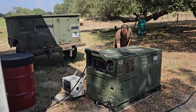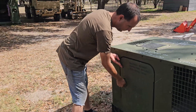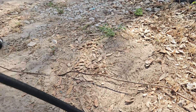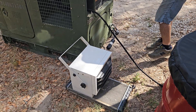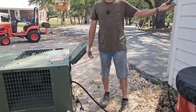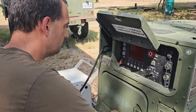The next day everything is put completely back together and I'm turning the breakers and power back on. You can see the generator is hooked up to ground over there, and I have my load bank set up using the old radiator I took out as a platform. I have my distribution block over there, external fuel is hooked up and the line is running all the way — my other generator trailer in the garage is where it's going to feed external fuel from.